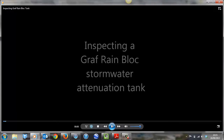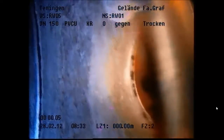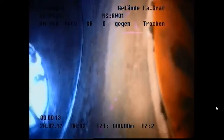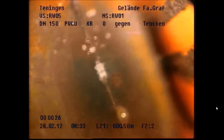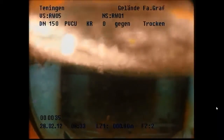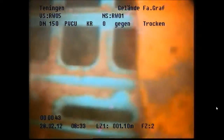On this video here, you'll see what you can see when you do access these tanks to take a look at what's inside. This is inside the manhole chamber which is connected to the tank, so there will be an access shaft or manhole chamber with a length of pipe connecting from the chamber into the tank. That's what this length of pipe is that the camera is in now. You can see down just about into where it meets with the crates. You'll see these green parts — those are the preformed channels in the bottom of the crates that the camera travels along. The orange bit is where the pipe ends and the crates begin. Normally that's just pushed into the crates by about 300mm and that's where the water will be coming into the tank.